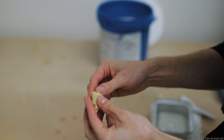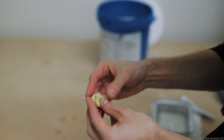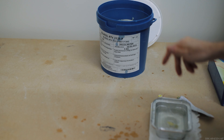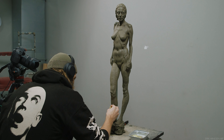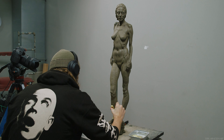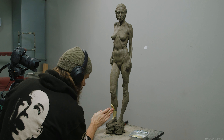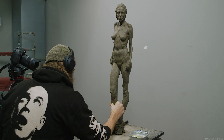In this video you'll see me working without gloves — this is not recommended. The catalyzer is not very good for you so I recommend using gloves at all times. At least mix the silicone with gloves on if you just can't stand wearing them. Remember to use a lot of water on your hands to keep the silicone from sticking. You can also use sunflower seed oil on your gloves if you find the silicone sticks to them a lot, however I am a little nervous about this practice because of delamination, so I don't use any sort of oils.